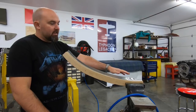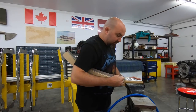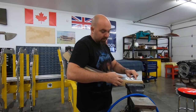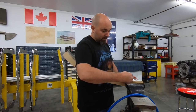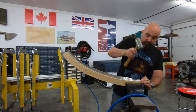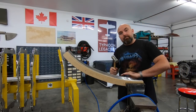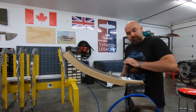You can see that's basically 90 degrees — it's vertical back around here, so it's pulling this material. It's trying to pull it apart to get that, which is exactly what I want it to do because it's going to help me, and I'll have to do less work later if I strike this flange down correctly. Same thing — glancing blows. In this case, because I'm doing it this way, I'm glancing towards myself, which will also help pull that material over.